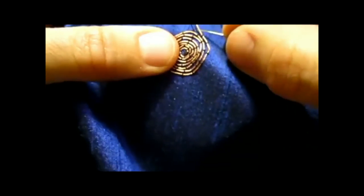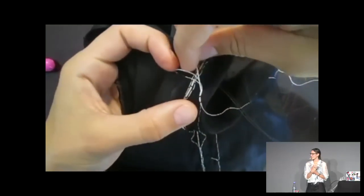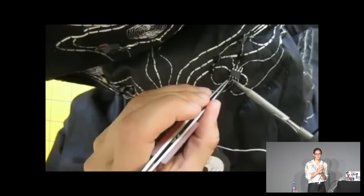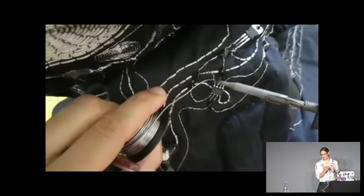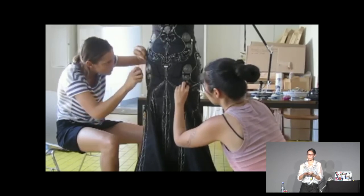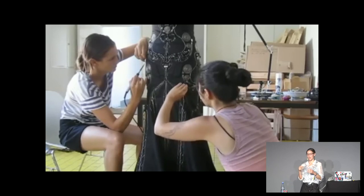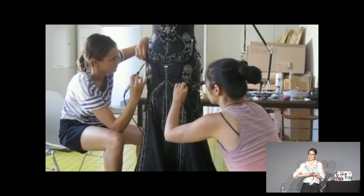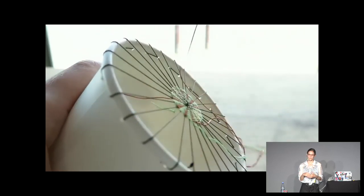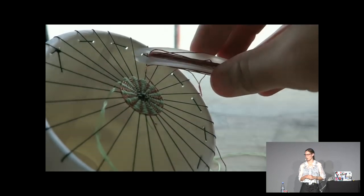This is a speaker coil that I'm couching down onto a piece of fabric. What got me into e-textiles was that I was not so much interested in technology — I studied industrial design — and I happened to take a course on sensor technologies. The instructor, Laurent Mignonneau, showed us how we could assemble our own pressure sensors by layering aluminum foil electrodes with a piece of Velostat in between. That moment of realisation that I was understanding what was happening — that we were able to make a force sensing resistor, that I could customise these interface elements and make them out of less common materials — and that I could use knowledge from growing up working with textiles to make my own electronic components and circuitry.